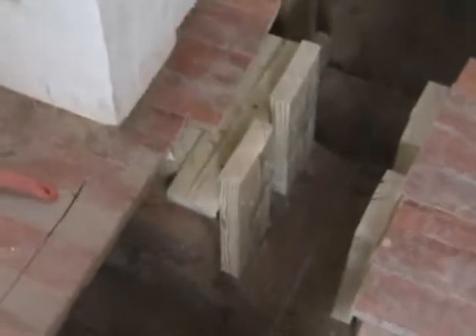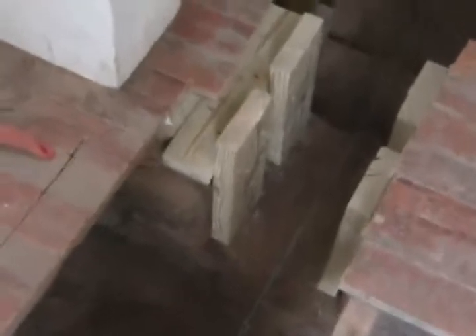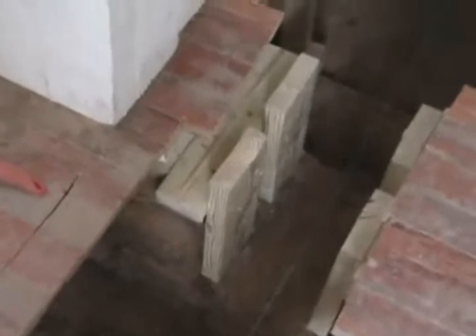Right there it's about almost eight inches above the lumber, right down the center. You see this structure that I built on either end of the adobe beam foundation. That's basically to keep the adobe from moving or pushing outward. I may actually embed a little bit of rebar just to help hold it in place and make sure that the beams don't spread.